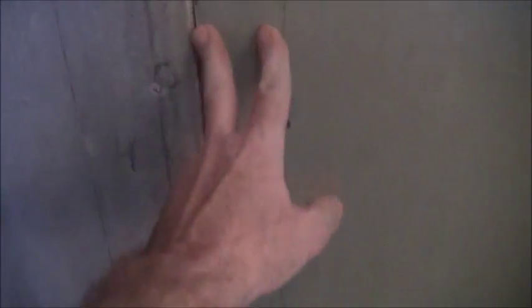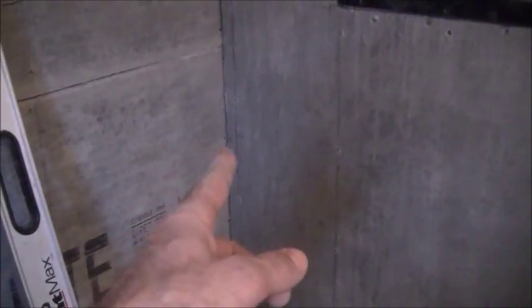I do wish that I had jogged this corner, because my tile is going to start here and go 24 inches out that way, and then this is the edge tile right here. I do wish I would have cut this longer from here over, like this one, because this one is actually the way that I should have done it. Hopefully that's not going to be critical on me. I'm going to do the joints up and everything, but I do kind of wish that I had offset that joint just like that over here. I had the 2x4, the wooden back of the wall, so I could have done it, and I had to trim that anyways, so I just had to leave that longer. But it's done, it's up, I'm not changing it. That is it. Okay.